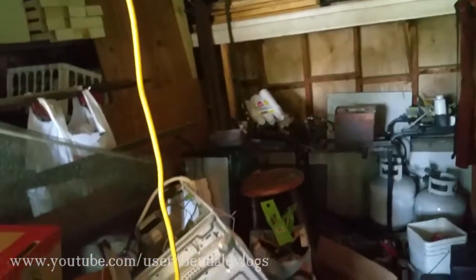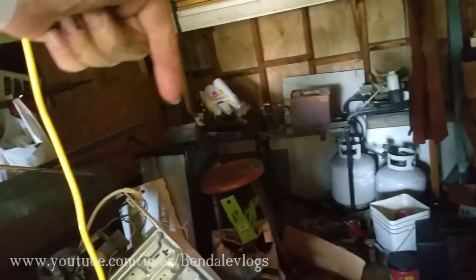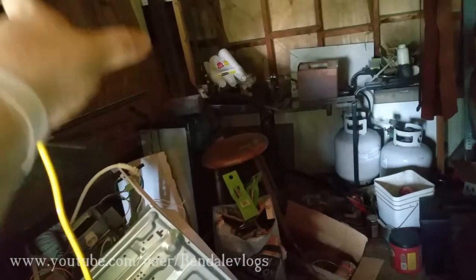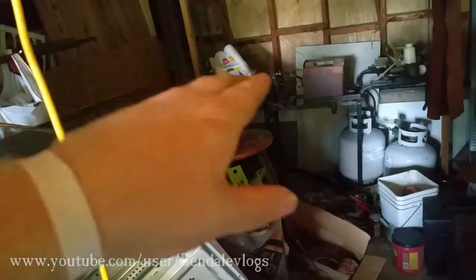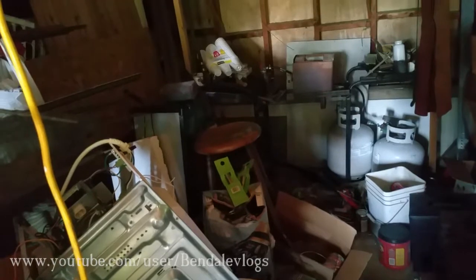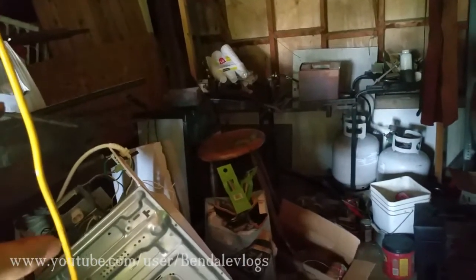With this one, because the forge blows from the top, when I put those 6 cans in on the top, they cause an insulation type deal. They insulate the aluminum below from the heat. So I have to put them in, I have to clear the dross, I have to wait for the aluminum to heat back up again, put a few more in.